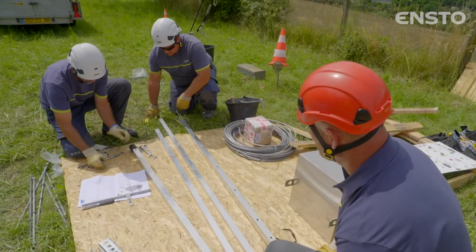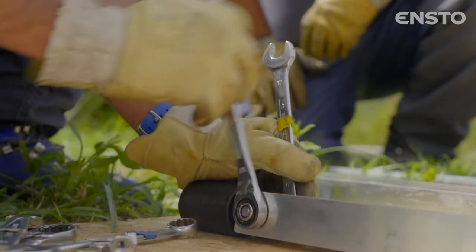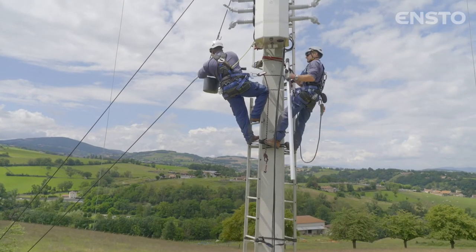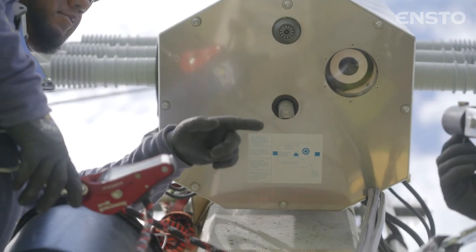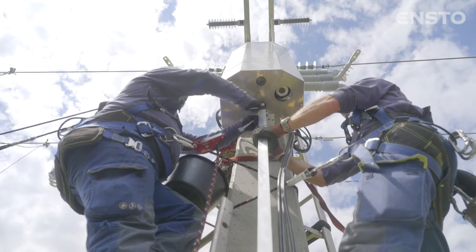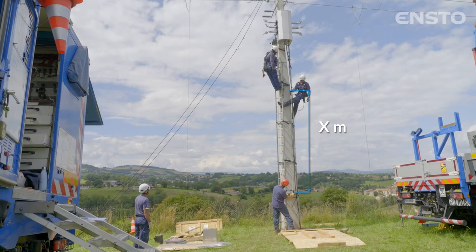Fit the insulator on the top female tube with one hole. Caution: excessive tightening could cause this part to break. Bolt the assembly to the control shaft, checking that its position complies with the label stuck on the cover, with the flat surface towards the pole side. Measure the distance between the bottom of the top tube and the manual backup control.